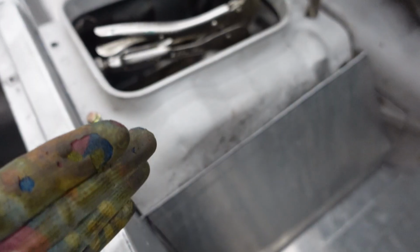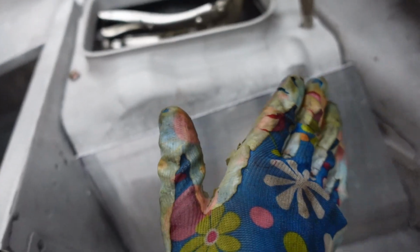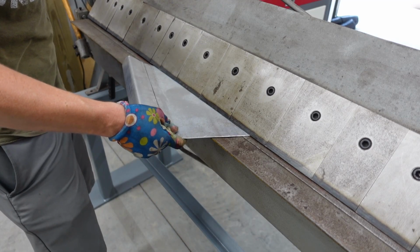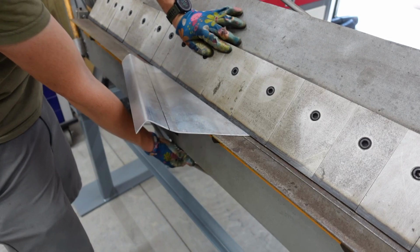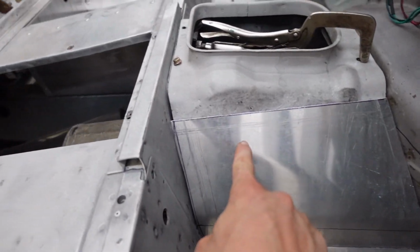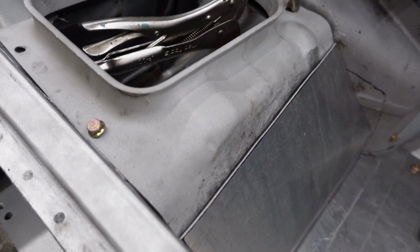See, we're up tight, but the tunnel tapers in towards the front. So we just need to come across with a bend from there to this angle, and that will kick that front in. So we're gonna go from this corner down to the edge of the bend there. Not gonna need a ton, so we'll go check. You can see that little bend there. That kicked that back forward, and now we're even across.